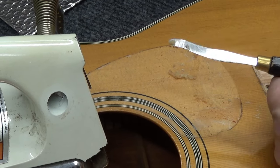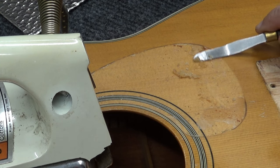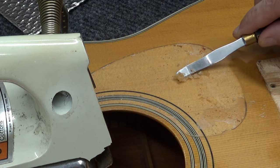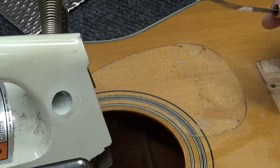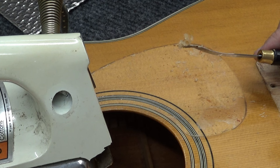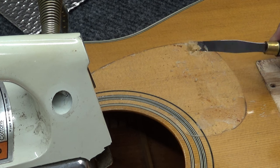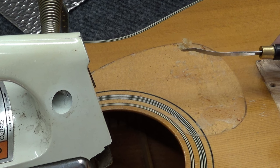I put a little acetone over here — I wanted to see, because the contact cement dissolves in acetone, whether those Taiwanese folks were crazy enough to use that inside the dovetail pocket where the neck is held onto the body. That would be nutso. But the stuff that was inside that Taiwanese FG 331, I call it Godzilla glue — it was green and rock hard as a crystal when cool, but like silicone when hot. I think that's the green epoxy that folklore has warned us about. I had to steam it for a while to get it off.